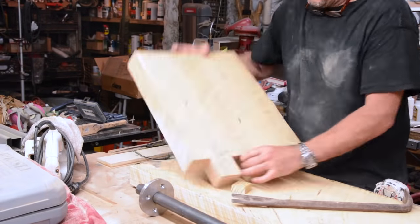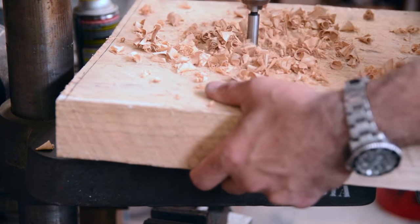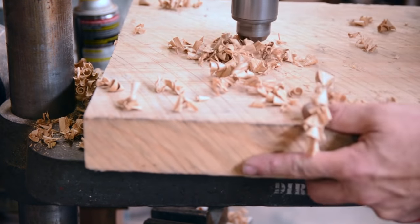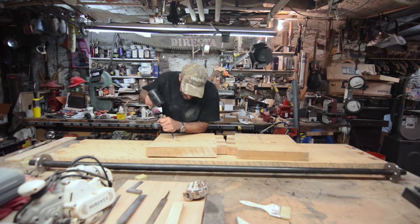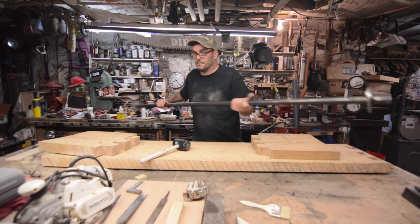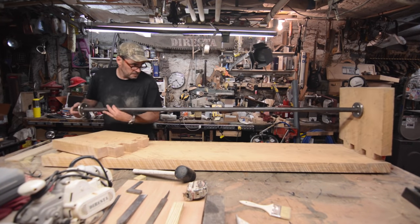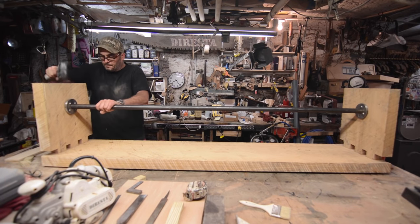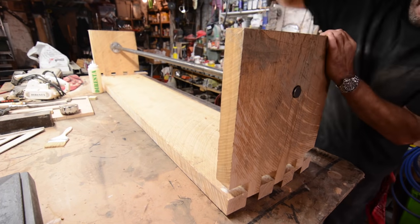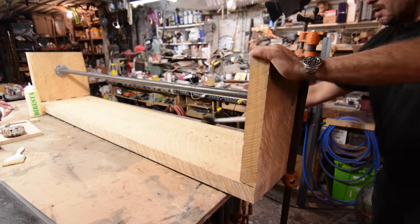You can see light shining through the gap — it wasn't quite the tight tolerance I would have gotten with the lathe. I'm removing the legs again, marking where the truss rod is going to penetrate through both sides. The wood drilled nice and easy. On the first leg you can see that little ink line — that's where I made up for the fact that one leg was too long. I trim out the material to make space for those welds, then everything goes back together. One side was still pretty hard so I had to use the clamps again. Then I apply some glue and use the pipe clamp to squeeze the joints as tight as possible.